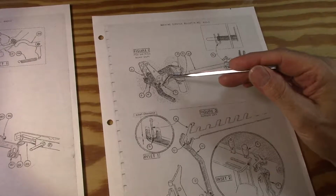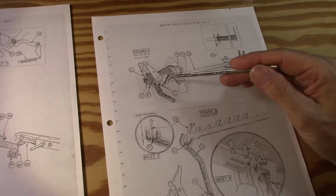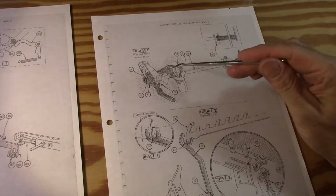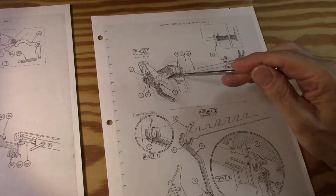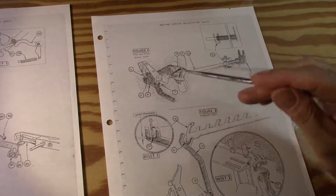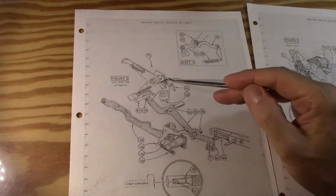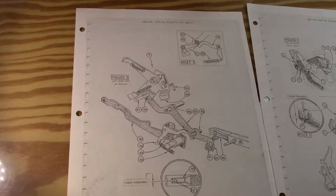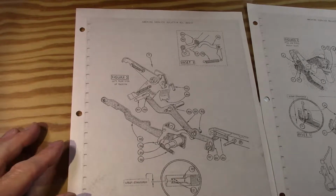I think I probably loosened and tightened alternately back and forth these two screws, maybe a full turn or two. That was just enough to bias this little adjustment plate that adjusts the position of this arm that ultimately moves this arm on the other side that moves this pin here. So hopefully that's all being followed, and that finally allowed it to work right, where hitting the divide tab button would allow the machine to successfully pull down its own addition, subtraction, and carriage shift buttons, basically.